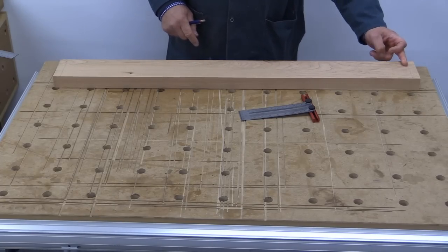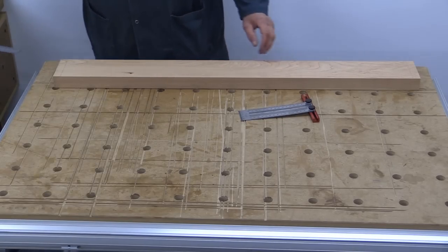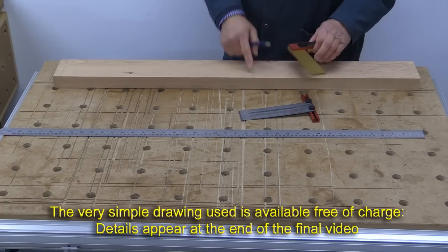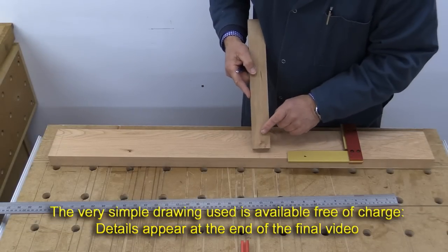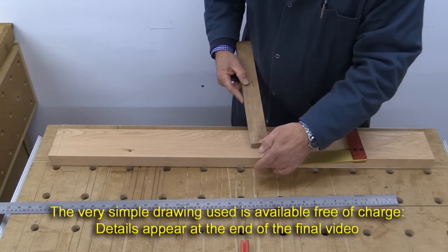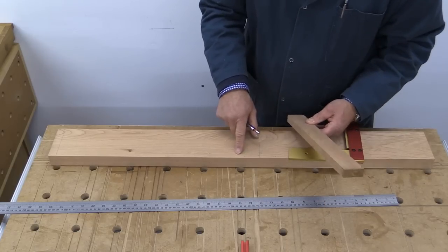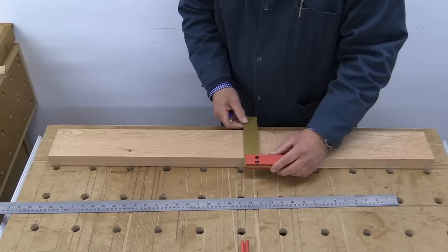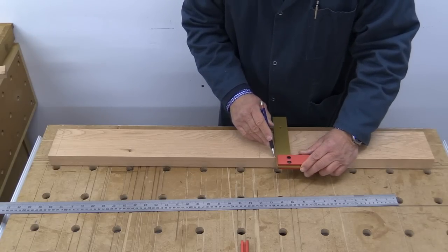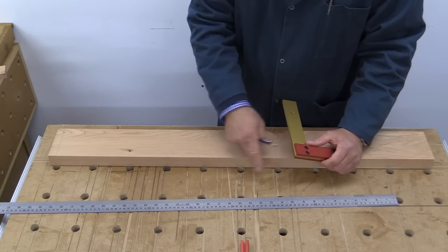That's 425mm from the bottom of the chair, so in my case with the extra 20 it's 445 millimeters. So that's my centre line through there. Now in this area there will be a rail going in like this, and the face here has to be flat in order to take the rail — we don't want it trying to be mounted where there is any curvature. To be on the safe side I'm going 15 millimeters beyond each side and putting a pencil line. This will stop me from doing any curved work in this area. We need to protect the flat face here and one we're going to create down here in order to get the joint correct.